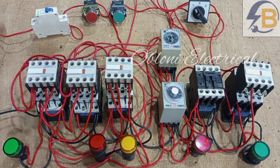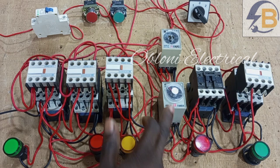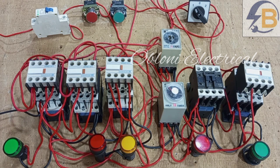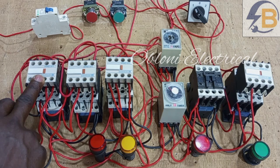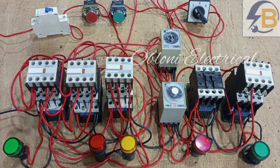The moment you switch the start button on, the mixing rod and the bowl start turning at the same time. This is timed — how long you want the mixing to happen is set on this timer. We are using a two-speed motor because at start we don't want the mixer moving too fast; we want it to start slow and then change to high speed later. This timer is wired for the low speed movement, and this contactor controls the low speed movement of the spiral motor.